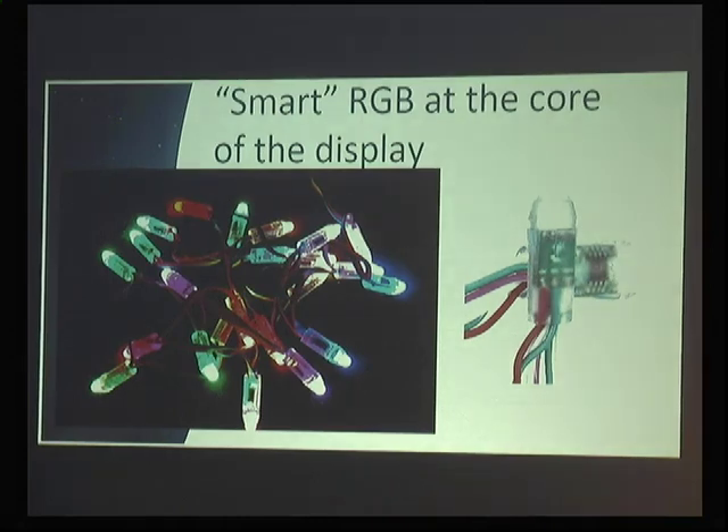At the core of all this is what they called smart pixels — individually addressable LEDs where every pixel has its own chip to take in data, interpret it, and drive the LEDs. There's a small chip inside each one. The smart LEDs let you send an individual command to each pixel to change its color independently — unlike a standard string where they're all preset to the same color. They are individually addressable all the way down the string.